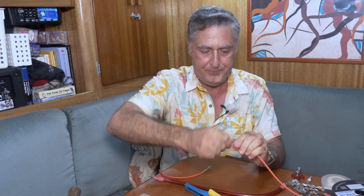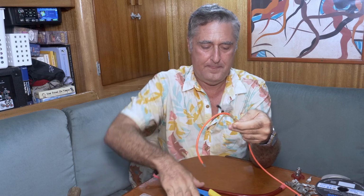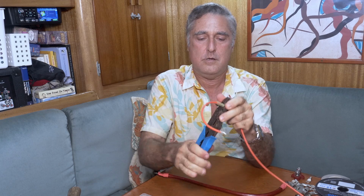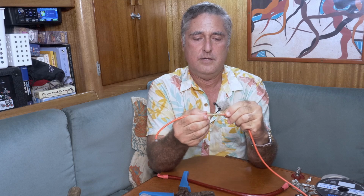Now this one is the Cadillac style, I called it, because of one thing. Well, actually, let's put the other wire in first so we can do it all at once. So I'm stripping some more wire, and I'll shove it in there. Make sure it goes into the copper. And I'll crimp that side. And give it a test. It's good.